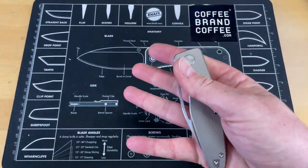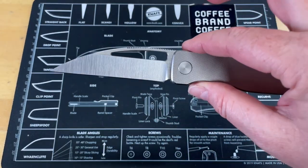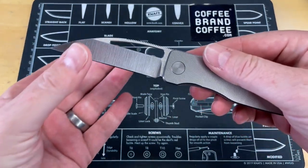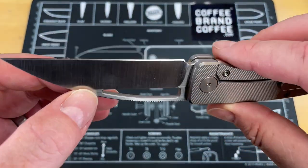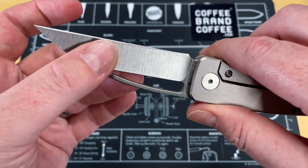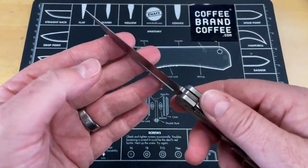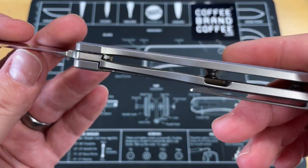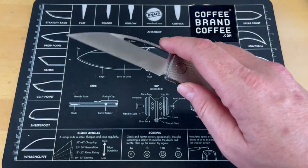This is a knife that you can pick up right now over at precisionknifeworks.usa.com. I don't make any money when you guys use it — this is just because Daniel has made an amazing knife. This is the Warren Tack, and this thing is probably one of the best cutting knives on the market right now, if not the best. You are looking at a super deep hollow grind on the production versions — 0.018 inches behind the edge. He's doing other ones down to 0.010 or even thinner that he's hand-regrinding. This thing is an absolute laser — frame lock done in titanium, super light because there's a ton of weight reduction — reverse flick only. And you've got this huge reverse flick aperture in it.